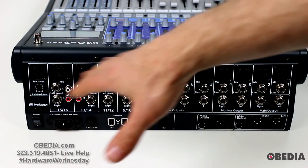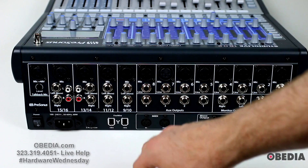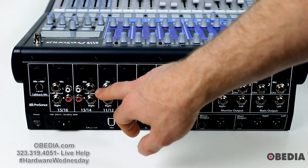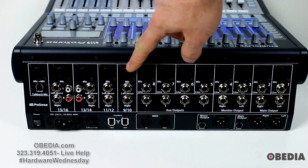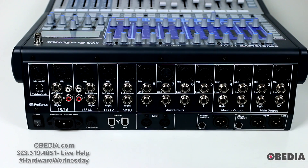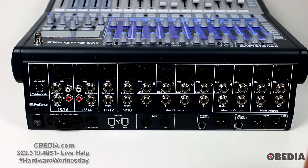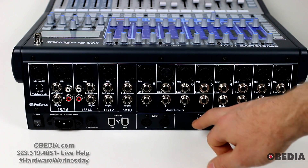Let's flip it around and look at the I/O. The back of the board is where all of your input and output happens — very straightforward. You have your talk back mic section and then each of your channel strips. Channels 9 through 16 are combo — stereo input pairs for standard quarter inch, with single mono XLR ins, and in some cases RCA. The remaining channel strips give you XLR as well as quarter inch. You have auxiliary outputs for driving studio or stage wedges and other monitor mixes, plus a monitor output, main output in quarter inch, and a main XLR output with gain control. There's also a mono output with a gain control.